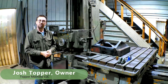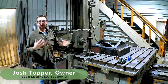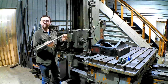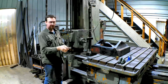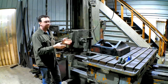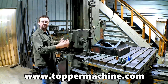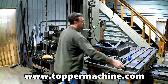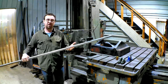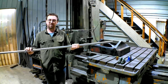Hello, welcome to Topper Machine. I'm Josh Topper. I'm standing next to my Lucas horizontal boring mill and I've got a job in here that I've been working on a video of, but I ran into a little snag. My current line boring bar is a little small, a little short. There's a one inch bar that I made a while back for a different job, but I need a bigger and longer bar. I've got this chunk of 4140 pre-hard, inch and a quarter, and we're going to turn this into a line boring bar with half inch square holes. Let's get it over to the lathe, get the ends trued up, and get started.